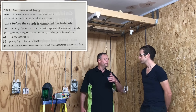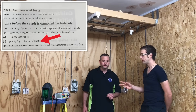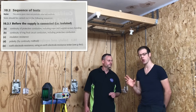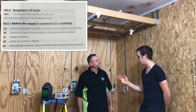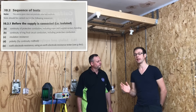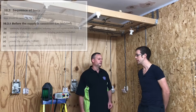In this case we're doing test 1 continuity, but we're not going to include test 4. What's test 4? Test 4 is polarity. Now if we were to use the other continuity of CPC test method commonly known as R1 plus R2 — which we will review in another video — when you do the R1 plus R2 method you can prove polarity at the same time. But with the R2 method we're not going to be able to prove that, so we would need to go back at some point and do that polarity test.